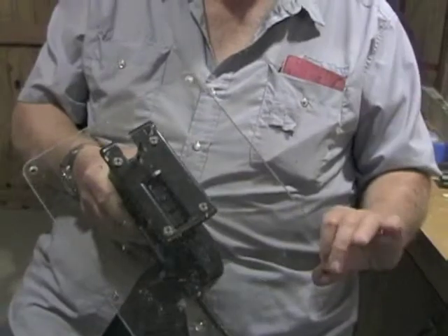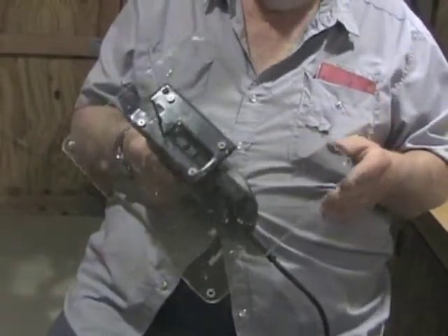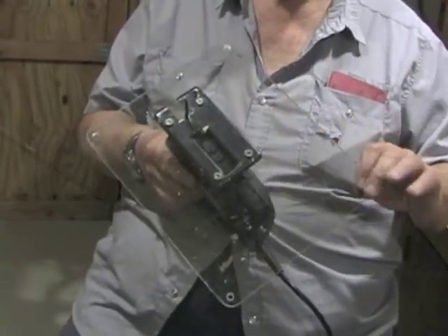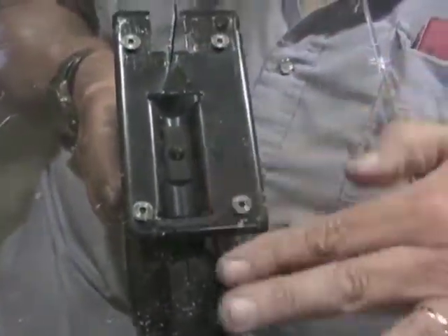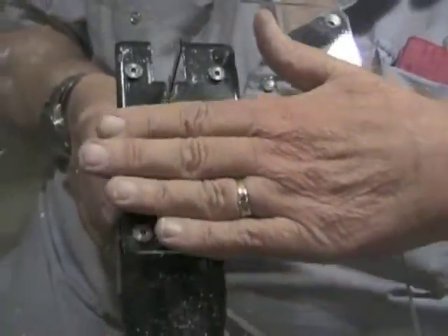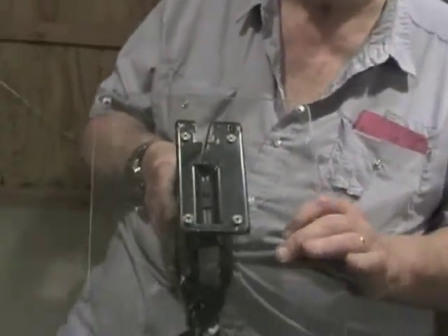The plastic is more or less the same size as a Kreg router table insert, and that's an industry standard — so that's just about what this is. I could take this and I think it'll fit in that Grizzly table, but I really don't care because this is for the saw only. It's Lexan — bulletproof glass, Lexan — a quarter of an inch thick. I drilled holes in it with countersunk screws, which are now flush so I can run a piece of wood over it and it won't hang up. I've got to put a couple of finger holes in it to get it out, and I've got tools ordered but they're on a slow boat from China.